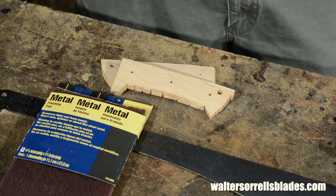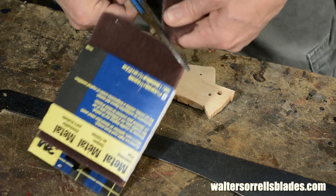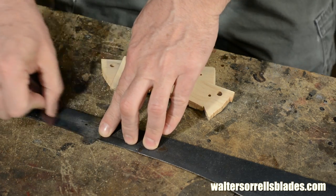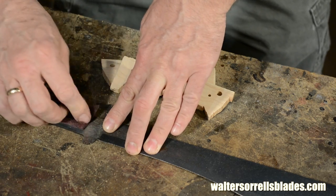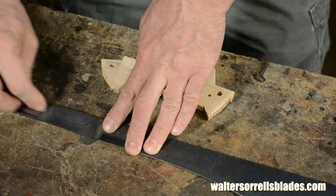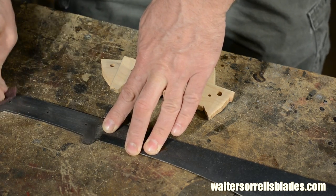Okay. Now I'll prep the surface for the epoxying. This is a really important step in epoxying. You'll notice that I left all the crud on the blade that formed during heat treating. That'll help inhibit rust, but for proper adhesion to the handle, we need to degrease the tang, then clean all these oxides, the soot, the polymerized oil, whatever crud is on there, we need to get rid of it using a heavy grit Scotch-Brite.